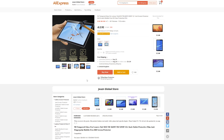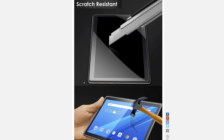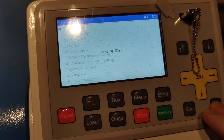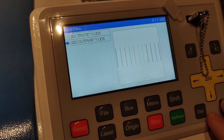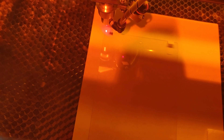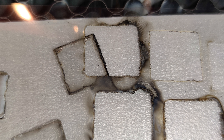So at first I ordered some large tablet screen protectors that I could then cut down to size and fit my screen. The plan was to cut the glass so it would fit within the recess. After waiting a month for the glass to arrive, I did some test cuts with one of the screen protectors as a sacrificial test — something to find the best speed and laser intensity for a good clean cut. While I was technically able to cut the glass on my laser cutter, no matter what speed or power I tried, I always ended up with a really badly burnt lamination material and cracked, rough edges in the glass. So it appeared there was simply no way for me to cut the glass.